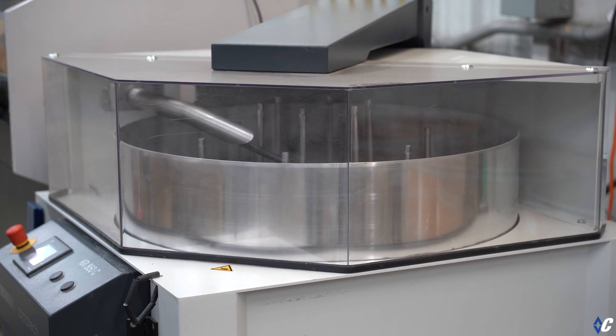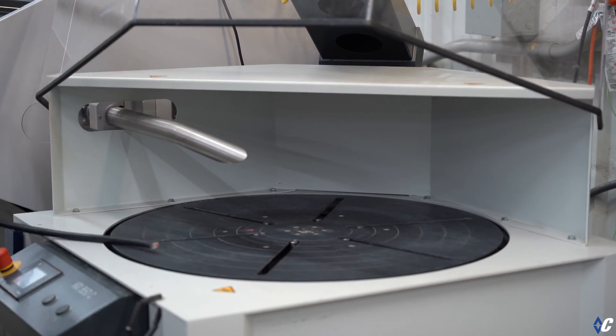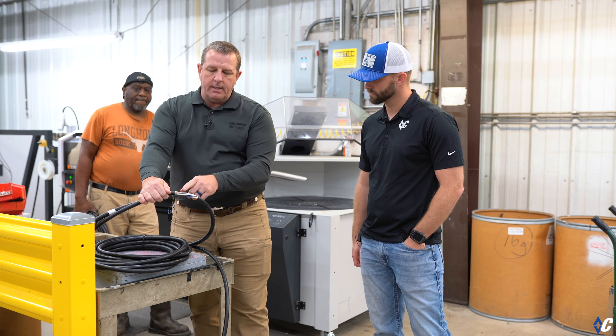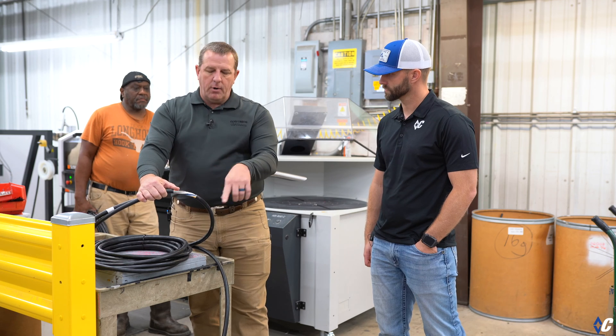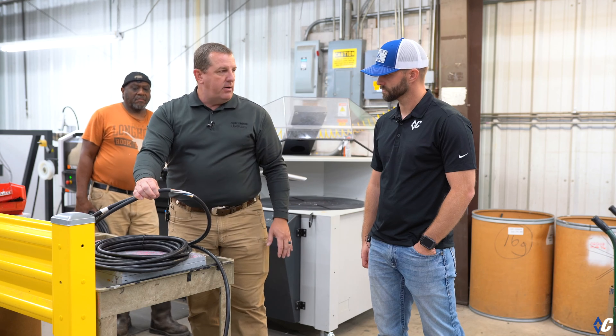This machine also strips both ends, and for brake drops it cuts the outer jacket. In another process, we'll splice in the brake line drops ultrasonically and then over-mold over that to completely seal this harness.